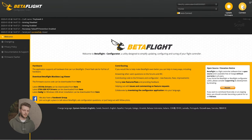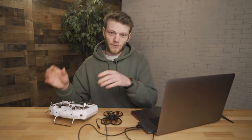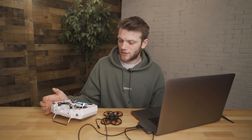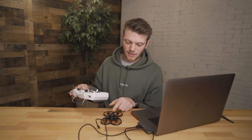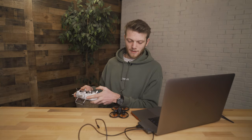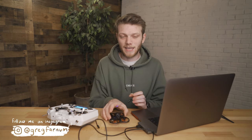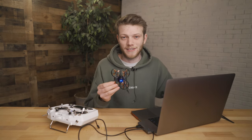Now go up and disconnect, then unplug the drone and plug in the battery. Make sure all switches on the radio are in the disengage position and throttle is all the way down. Now we can test — turn on the beeper by flipping that switch, and that works. Flip up the arm button and the propellers spool up. Give it a little bit of throttle and it starts taking off. In the next video I'll show you how to set it up with the goggles so you can start flying FPV. Hope this helped — hit like and ask questions in the comments below!